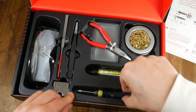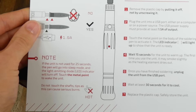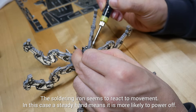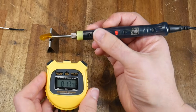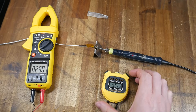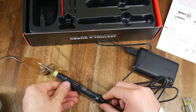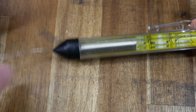So how about the toolkit? Well, I'm pleased to say that everything here worked as intended, and the only thing that gave me some frustration is the soldering iron. It's got a built-in sleep mode that turns off the power after 25 seconds. I'd often find when doing multiple solder joints I would start really well, but then the soldering iron would suddenly lose heat and I had to shake it or press the button to get it to turn back on and wait for it to heat up again. I did some experimentation after finishing the build, and if you jiggle it or press the button constantly, it will switch off but then switch back on immediately. I also tested the output temperature with a thermocouple, and if you're willing to keep it alive like this, it will maintain somewhere around 300 degrees constantly. This definitely isn't a workhorse, but it is handy to have a portable soldering iron you can take to a car or 3D printer. It's also worth mentioning that there's plenty of solder left over for future projects.